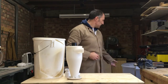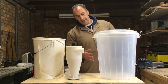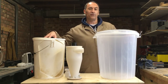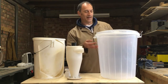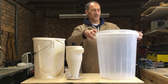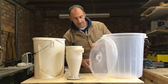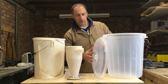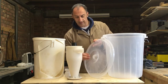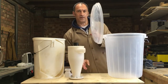So what we've done is we've purchased a new bin — a lot bigger, this is a 50-litre dust bin and obviously clear. The one thing we found with this system is we didn't know when it was full, so obviously now we'll be able to see exactly how full it is and know exactly when to empty it. A lot stronger bin than the previous one. I'm not planning to use this lid however — it's a little bit flimsy. I need something quite sturdy to sit the cyclone on, and also with this molding here it's going to be very difficult to get a decent connection — there's nothing really to screw to here, so I'm going to dispose of this lid.